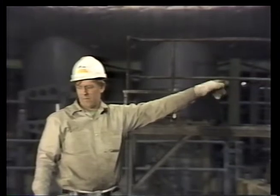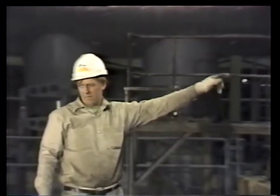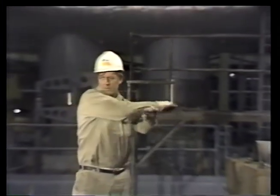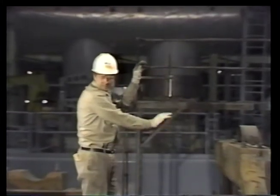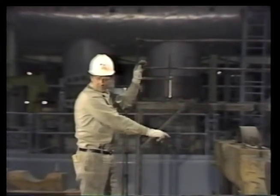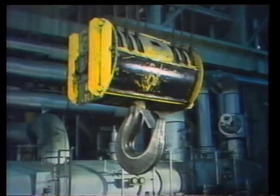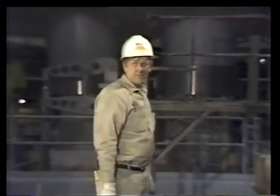The first thing he has to do is get the crane into position. This is a signal for travel. A standard set of signals must be used in all crane operations. When the hook is approximately above the load, Norris signals lower the hook. When it's low enough, he signals stop. Now it's time to mount the rigging on the load.